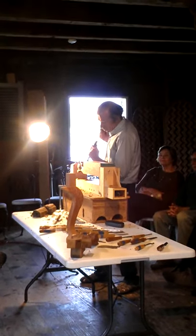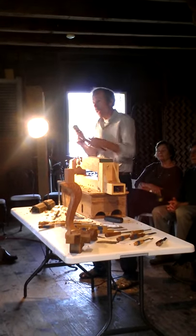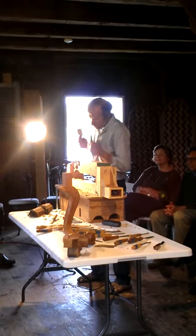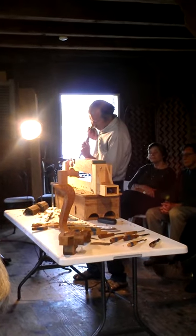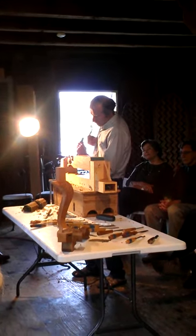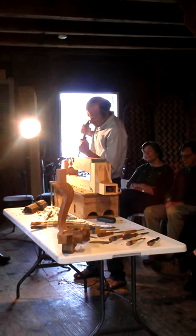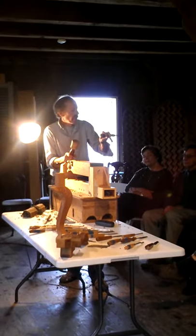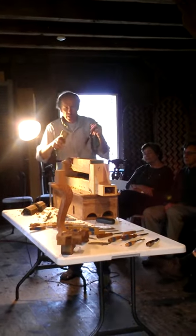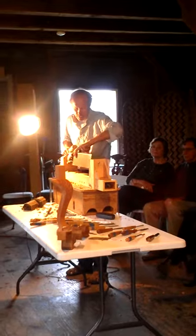If you don't carve with both hands, you're constantly having to reclamp the work to accommodate the direction you're going. Someone who's just right-handed would have to carve in one direction and then spin the piece around. Teach yourself to carve with either hand — it's a lot easier. What I'm doing now is taking a gouge that's a fairly curvy one, a number eight, and I'm doing the hollow between the claws as it comes up towards the ankle. There's a hollow space in there where your thumb can fit, so I'm just starting to make that transition.